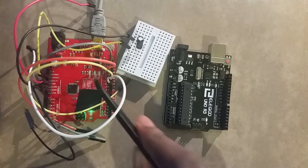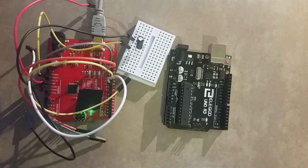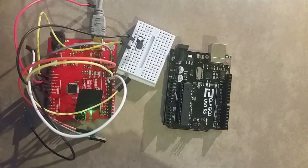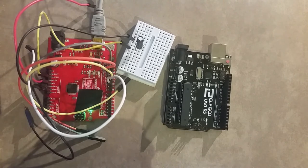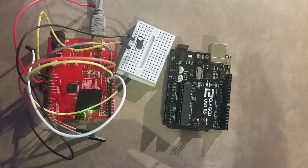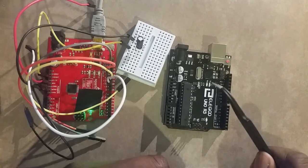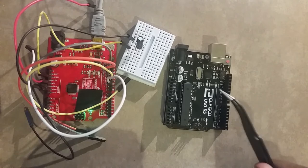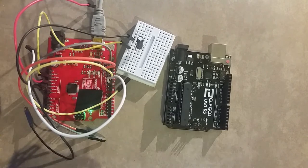So make sure that your board has an Atmel ATmega8U2 or 16U2. This is a SparkFun Red board, and it has an FTDI chip on it, and I can't flash the Hiduino firmware to this chip. So just look out for that. If you have an off-brand board, make sure you have the proper chip. Also, for information, once you upload Hiduino onto this chip, you won't be able to upload sketches via USB anymore like normal. I will show you how to upload new sketches once Hiduino has been flashed to the ATmega USB microcontroller.